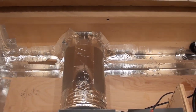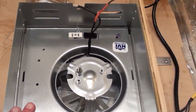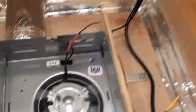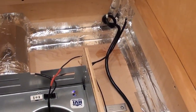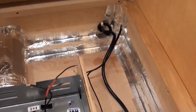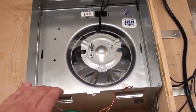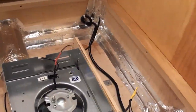The fan doesn't give me many mounting options. This one moved 80 cubic feet per minute; the new one moves 273. On this one the motor is inside the airflow, but on the new one the motor is outside the airflow, like it should be. That motor is cheaper than the equivalent bathroom fan — the new fan cost about $30 more than this one, but if you look in the right places you can get a good fan.